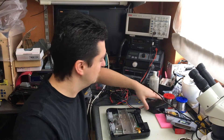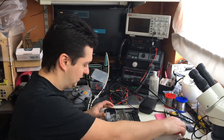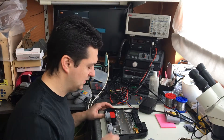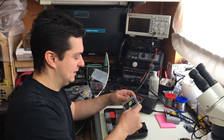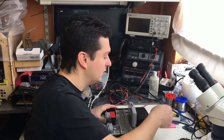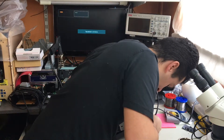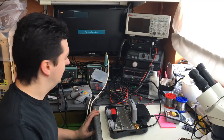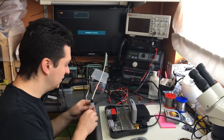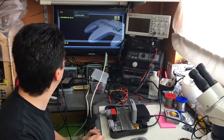I have my power supply here — that's plugged in. You need the expansion pack or the jumper pak that comes with the N64. I'm just going to put in my EverDrive and put in the power brick. We connect the mini HDMI to the console — this is a really snug fit. Put on the TV, select the HDMI channel, take the controller, add it, and power on. We should get something if everything is okay.